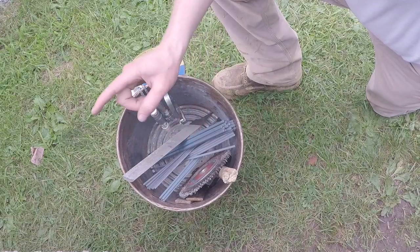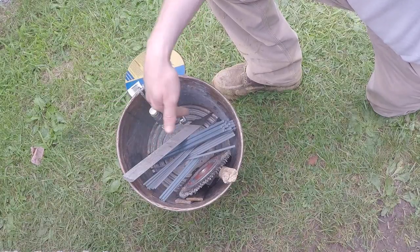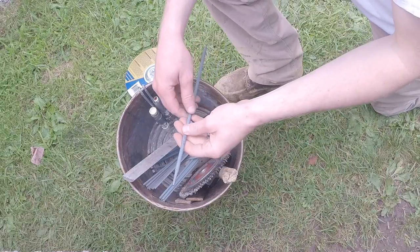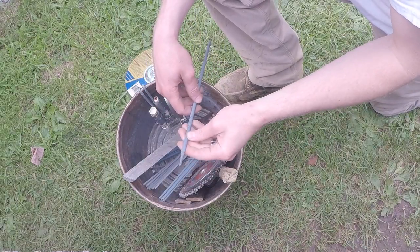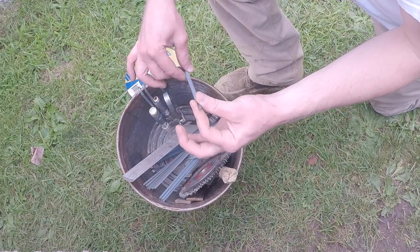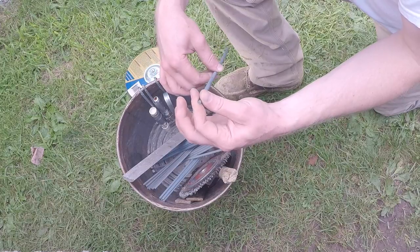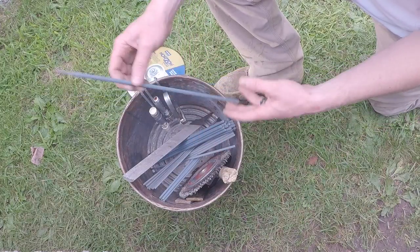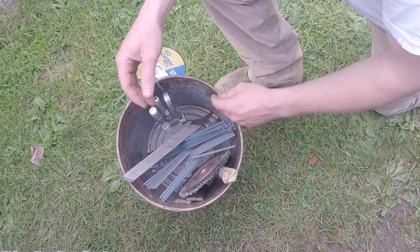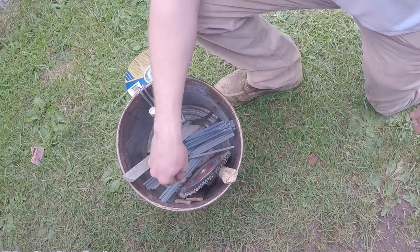Normally I like to carry a little bit of everything, but again it depends on your welder and the size of pipe. The sizes are: 1/8 6010, 5/32 6010, 5/32 8010, and 3/16ths 8010. Quick thing to remember — they have 3/16ths welding rod and they have 5 millimeter, which is just standard and metric sizes. 5 millimeter is very similar to 3/16ths in diameter, so if a welder says 5 millimeter, he's talking about a 3/16ths. And 5/32 is also known as 4 millimeter.